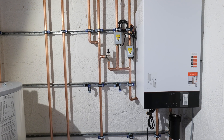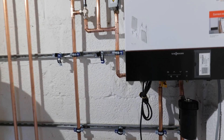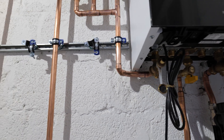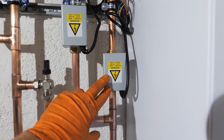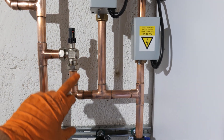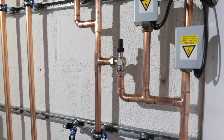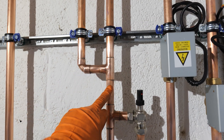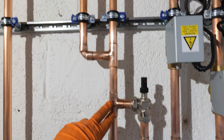That is the central heating flow and return to the boiler pretty much done, other than the filling loop. So let me run you through what I've done so far. Underneath this Viessmann 100 boiler, far left, that's the flow — it comes under there tight to the boiler and then we're straight into our zone valve. We're going to have two zones — upstairs and downstairs — for our central heating. Because we're pretty much doing an S-plan on the central heating we need to add the auto bypass, so no low-loss header on this one — there's no need for it. We've got the rads running at the same temperature, no underfloor heating, so auto bypass straight into the return. I've put that in after the two returns tee in, so basically we've got this loop here that just goes around and around the boiler should it need it.